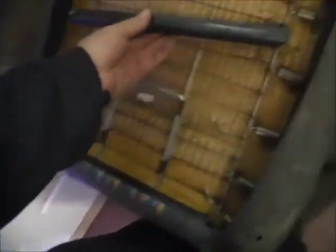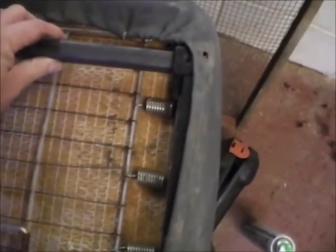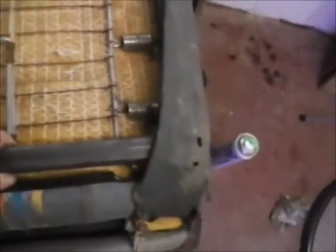Right, so following day, a little ponder on mounting these seats in, or seat I should say, only one, isn't there? And the plan I've come up with, because I want to keep the overall height as low as practical, is just an offcut of box section here, but I'm going to cut that so it fits in, recess there, that will bolt in then with a front and back.